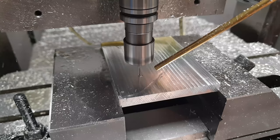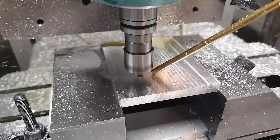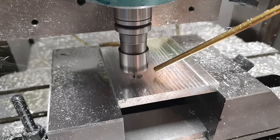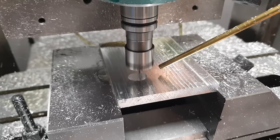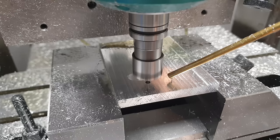Okay, here goes nothing. The entry helix is way too slow, and the optimal chip load setting is way too aggressive — RIP my first tool ever on this machine. Okay, better. That still feels like way too much material for such a tiny end mill. But in general, the utilization of the entire tool length that one of Mekatron's experts recommended really works well. For better chip evacuation I've got to avoid these narrow deep holes though.